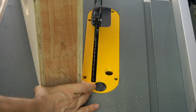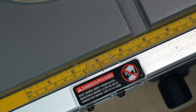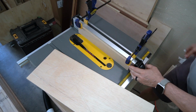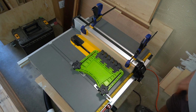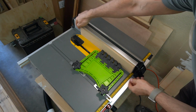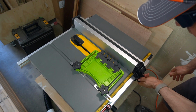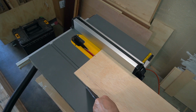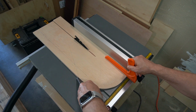I knew that the space inside of the boom arm is 3 inches, and I set that on my table saw. This is the only measurement I used. Next, I stacked and clamped the 2 MDF pieces for the extension sides to my table saw fence. The remaining space between the sides and the table saw blade is the width of the bottom of the extension arm. So to capture that width, I placed a feather board on my table saw so that I was just touching the MDF pieces. I removed the clamps and MDF and then moved the fence until it just touched the feather board. And then I cut the bottom of the extension arm to the exact width I needed without measuring anything.